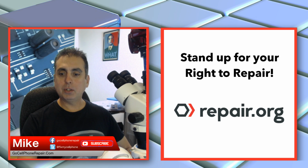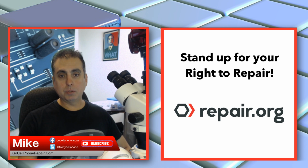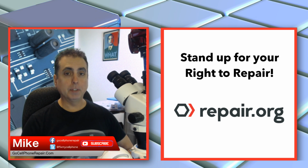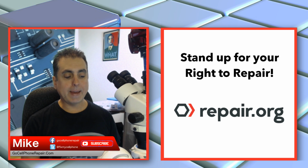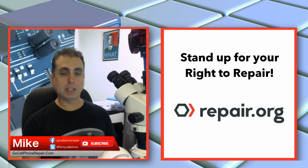So I wanted to show you guys this real quick. I think it's on. I've got it set up here. A couple nights ago, I got an iPhone 6s. And a lot of times when we get the backlight issues with those, as you probably know, it's usually something pretty minor. A lot of times a filter will get blown, and that protects the circuit and keeps other things from being damaged in the process. Unfortunately, that wasn't the case for this one.